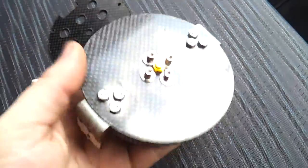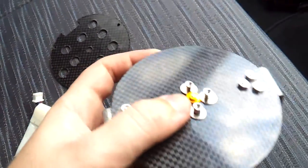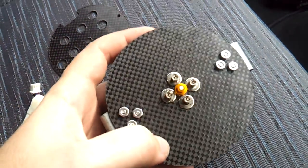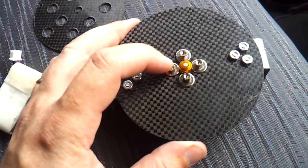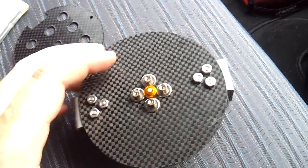The weapon is made from another piece of carbon fibre, 100mm in diameter, screwed onto the motor. I drilled 4 holes through the top of the motor — disassembling it first, of course — then tapped them with a 3mm tap and ran 4 screws into the motor.